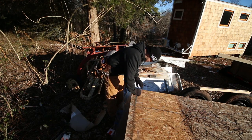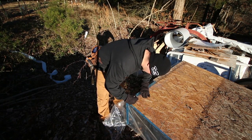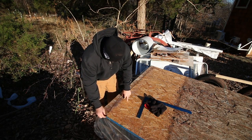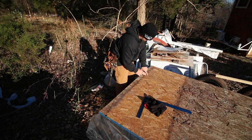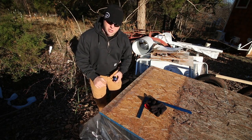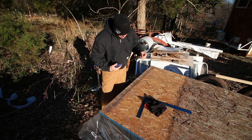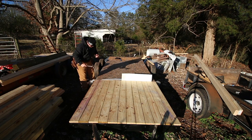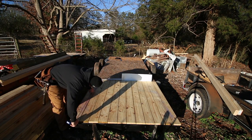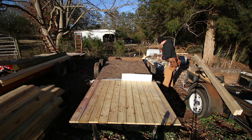I'm going to mark it in this direction and then come and do it in this direction as well, then repeat that on all four corners. Then I'm going to take a chalk line with some black chalk — I like black the best, it stands out the best. Red is also good, not blue. And snap that in. When I'm snapping a line, I'm making sure I'm pulling straight up and letting go. You can snap it several times. The tighter you pull it, the better it'll be. You want your finger to feel like it's going to rip off.